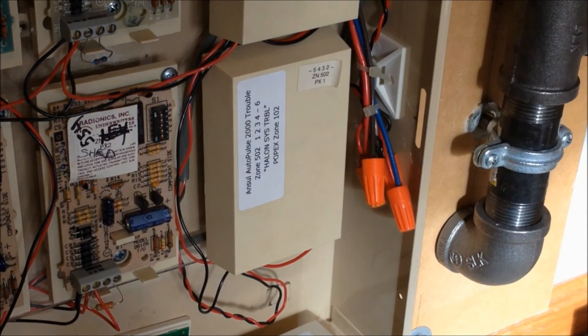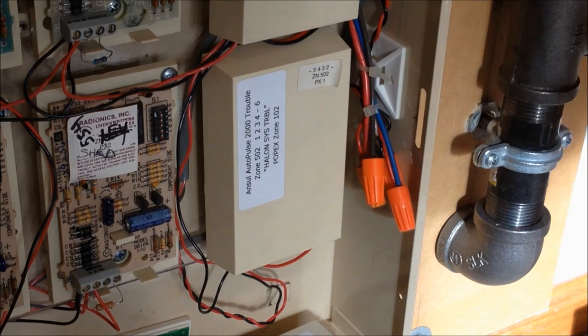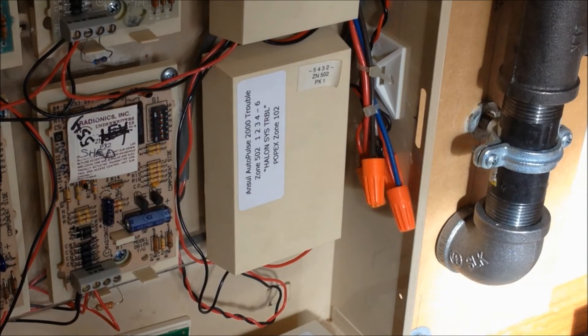That was fine until recently. You'll notice these two modules still have covers mounted on them because, unlike the rest of the modules in this panel, these two are fitted with tamper switches which require the cover to remain on so the magnet on the inside can activate the magnetic reed switch for the tamper condition. The cover on this module became slightly loose, so it was constantly trying to report the tamper condition back to the panel and getting no response because there was no zone assignment. It flooded the whole data channel — which is only two conductors — with its tamper message, and nothing else could get through.